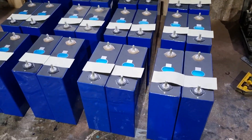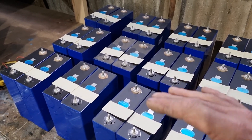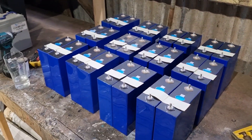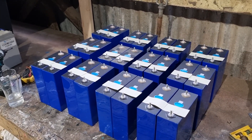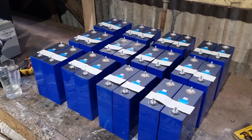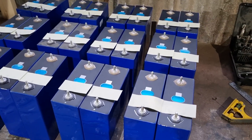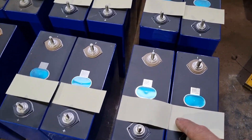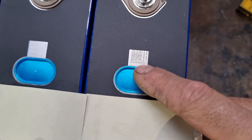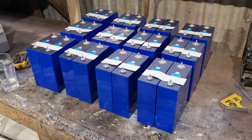What I'm doing at the moment is organizing the cells by serial number. They've all got a serial number on them, but because these cells are B grade they're not all made in the same batch. I want to get them organized into eight sets of the most common serial numbers — the ones built closest together — and then I'll start top balancing them. I've got a little sticky note and I'm writing the end of each serial number on it.